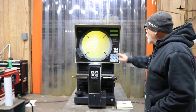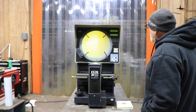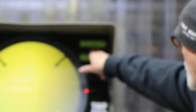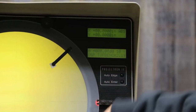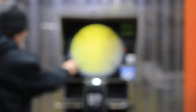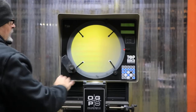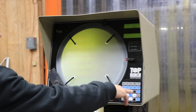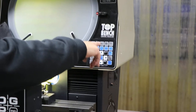This particular one has a new chart glass on the screen. You've got your X and your Y axis display up here in the corner, as well as your degrees and radius, and degrees and minutes in the bottom display. You can move that by turning this here. All your controls are here for your geometric functions and to set and reset your zero, your DRO.